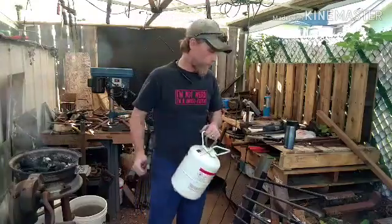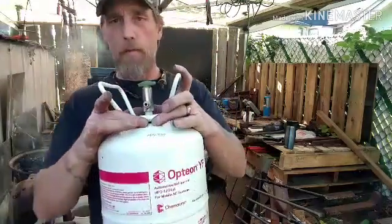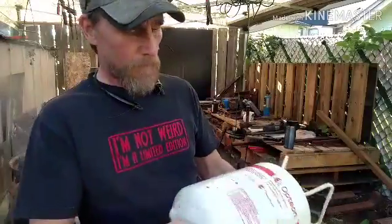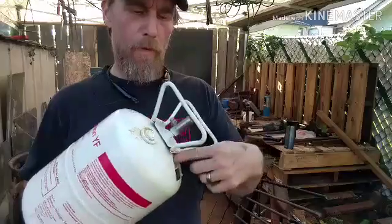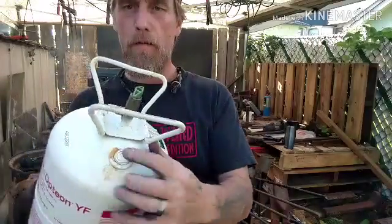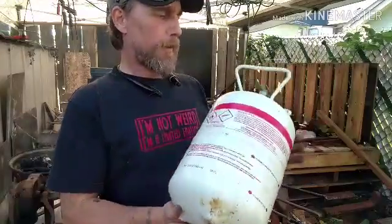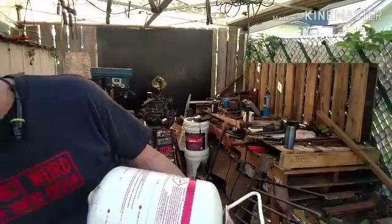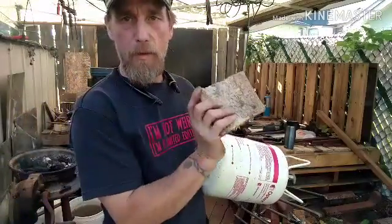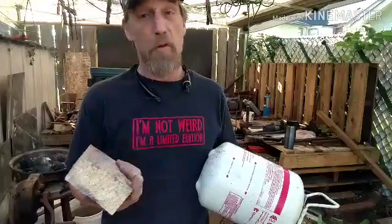This is my new forge. I'm gonna cut this up too. Cut the top off of it. Cut it this way. Put a hole, and I'll probably just take that out. Put the pipe down through there. This will be the front, this will be the back. Drop some of these bricks here. I know they're not the right bricks, but they are fire brick for the fireplace. It's only running charcoal.